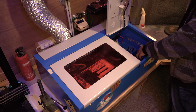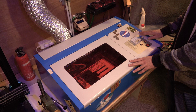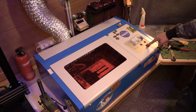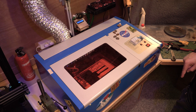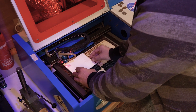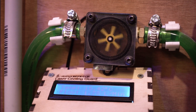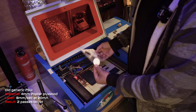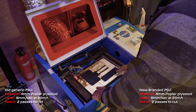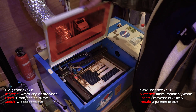Okay, the moment of truth. I put everything back in, including the little plastic spacers, connected the high voltage line, and everything should be set up and ready to go. Let's turn this thing on — three, two, one. Since I did not change anything to the initial setup — meaning I did not touch the laser tube or the alignment of the mirrors — I cannot compare if the new PSU gives me better performance. On the last project I used 8mm per second at full power, which was 38 watts or 20 milliamps, and still needed two passes to cut through 4mm plywood. It did not improve the cutting rate, and I'm pretty sure my laser tube is reaching the end of its life — so that will be an upcoming video.